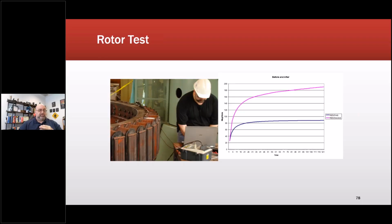We don't know which parameters for those we will be using. They're trying to make it generic. What they did do is send out a survey through ESA, which I collaborated with ESA to get out to a bunch of others to see who did the PDCA. Nobody did, except on the utility side. For the insulation resistance profile, everybody goes, oh yeah, we do that, or the polarization index test. So you're referring to the charging discharging thing.